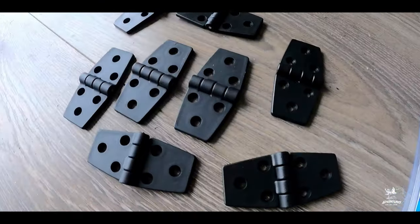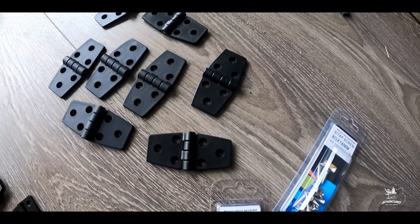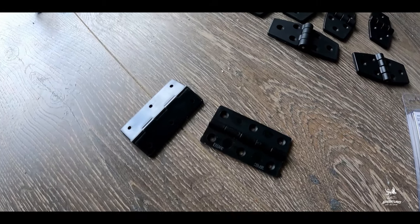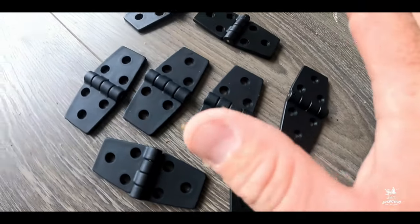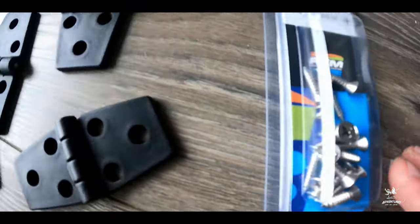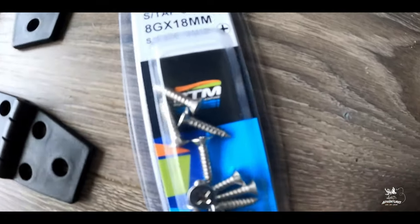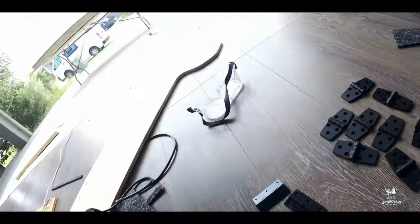This is an exciting time - now I'm putting the doors on top of the casting deck. I've got these nylon hinges, pretty awesome. It goes into the top of the casting deck and gives it a nice fishing boat look. For the anchor door near the bow I've got nylon hinges too. For these hinges I'm going to use 6G 12mm screws, and for the hinges on top of the doors I'll use 8G 18mm. The shop didn't have shorter screws, so I'll put them in from the top and grind the ends flat on the bottom.